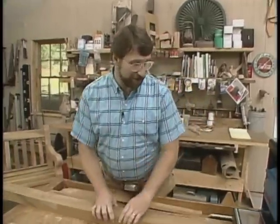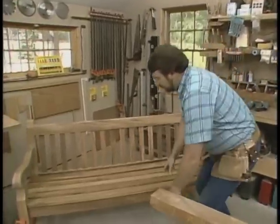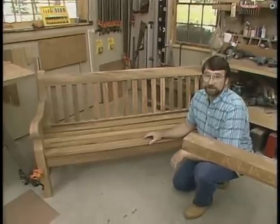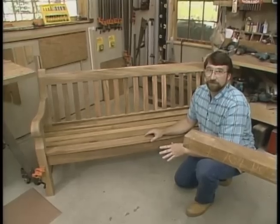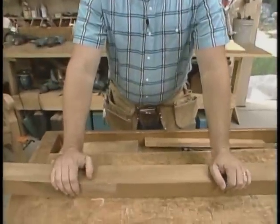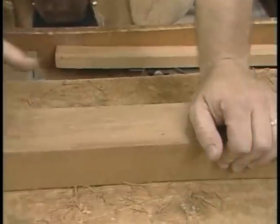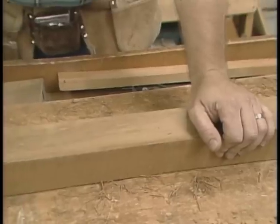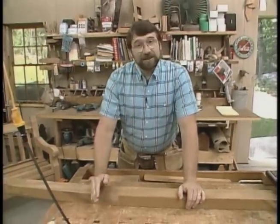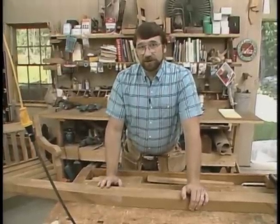Boy, that is tough stuff. Teak. And when it came time to build our garden bench, what other choice would there be? Especially after seeing how all those garden benches held up so well for decades without any maintenance. Now it's expensive and you're going to have to search around for it, but it's well worth it. I managed to find some rough teak and plane it down myself. I learned a couple things about teak: it drills, saws, and sands beautifully — it's very predictable. But to plane it for thickness, it dulls planer blades quicker than you would believe. What I found out from reading in one of my wood books was that it contains silica, and that might be one of the reasons it dulls the blade so quickly.